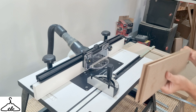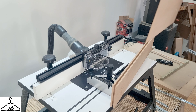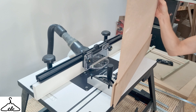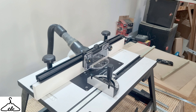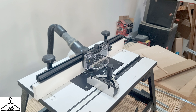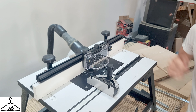There we go — perfect groove in the centre, eight mil deep for this particular job. Let's go ahead and do the smaller edges. Perfect groove to do your Shaker style doors and to put that six mil panel in. It works absolutely perfectly — the perfect amount of resistance for the panel to slide in. A bit of glue in there and that will give you the perfect joint, along with the false tongues that you'll be sliding in to join the stiles with the rails. This machine — this is what you can achieve: make Shaker style doors like this in no time at all, really easily and quickly. No dust whatsoever — can you see any dust coming out of this machine? Not a single speck.